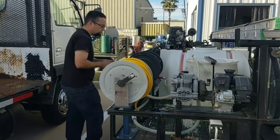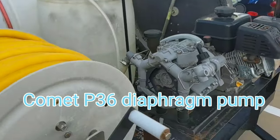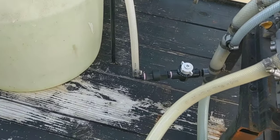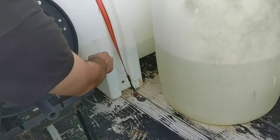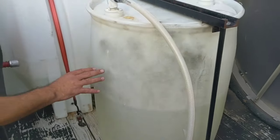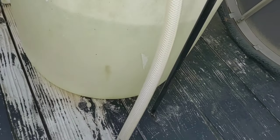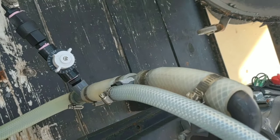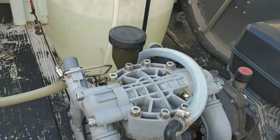This is how we do metering on the Comet P36 system. We had a different one that was a little different, but what we found is there are two major components in this: water and bleach. With your bleach, you can put in your surfactant and batch mix it with a bleach-stable surfactant. You don't really need to have a third metering tube for your surfactant. Some people could do it for different purposes, but for us, we don't need it.